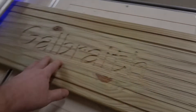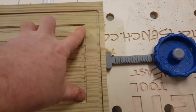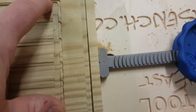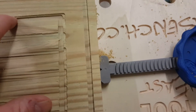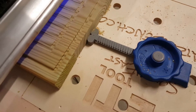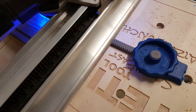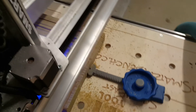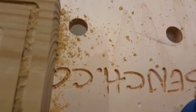I definitely like the deeper cut, but in VCarve I apparently missed the edge of the 3D for the text string here — so it cut it here. Now I just drew another offset line, 3/16, because it's less than the quarter-inch bit, and that'll clear this. The way I drew my rectangle wasn't quite at the edge of the 3D texture. We'll see if that cleaned it properly — I think it will.